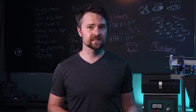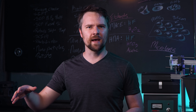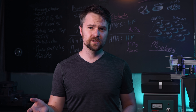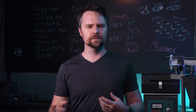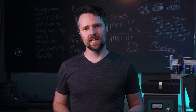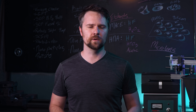There are lots of ways you can etch silicon. A lot of times the wet chemical methods need a hard mask on top of the silicon with something like silicon nitride. You can also use deep reactive ion etching, which essentially fills a chamber full of reactive gases and then hits the silicon with an ion beam, etching in a very deep manner. MACE is an alternative to all of those, using a pretty clever mechanism that was only somewhat recently discovered. MACE works by using a specific etchant and a noble metal, typically gold, but sometimes silver as well.